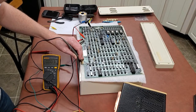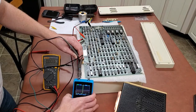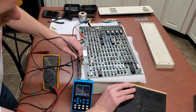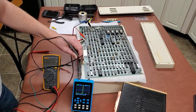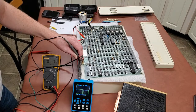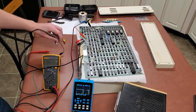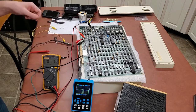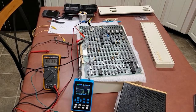We're on five volts per division, so this should be about 12 volts — RS-232. Yeah, that looks right. So pin four there — now we can trace that out to the display port on the back. Let me get it hooked back up and we'll take a look at it.